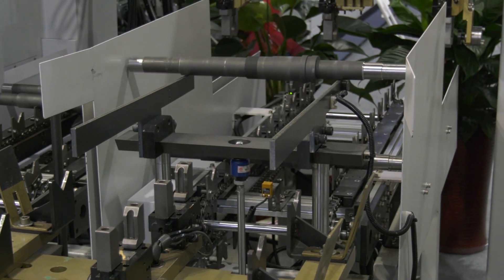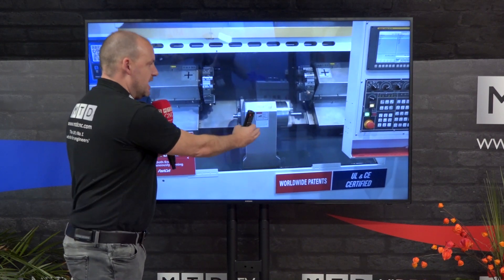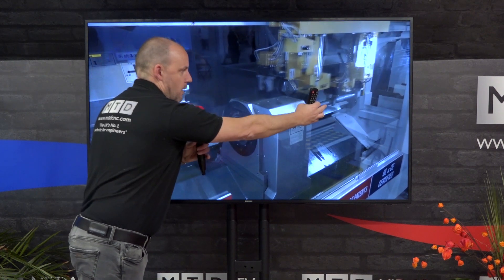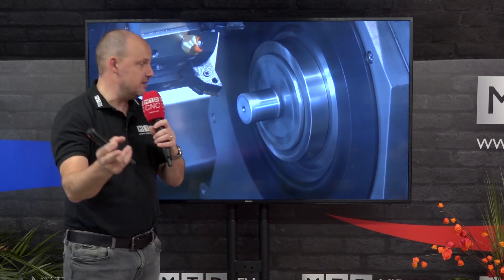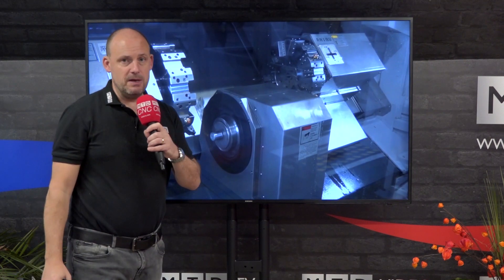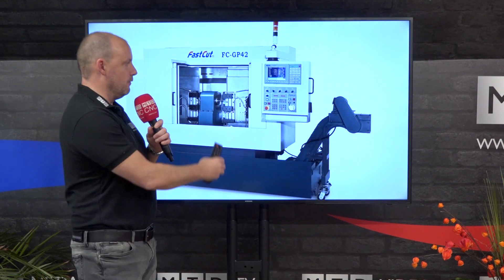This component has an OP10 and an OP20. One machine for OP10 — which we see here — is a slightly different machine: a central spindle with two turrets. The component is fed through the spindle, and each turret performs a facing and center drilling operation simultaneously on both sides. Both turrets are independent, giving you two operations and double productivity.